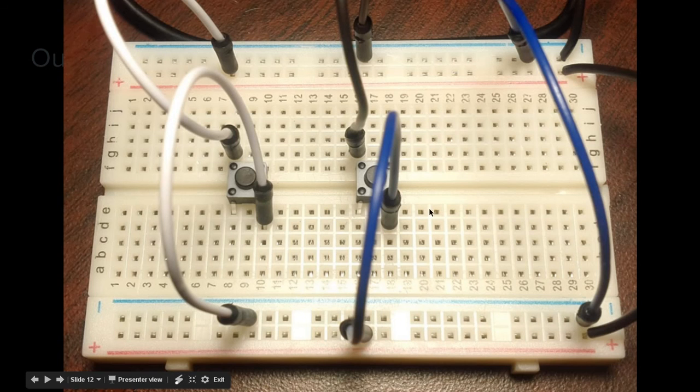Here's how I set it up. From this voltage line up here, I've connected a button, and then connected the other end of that button to the ground. So when I press this button down, it makes a direct connection from the positive voltage source up here to the ground. And then same over here, except this voltage source is connected to the button, which then is connected to the ground.